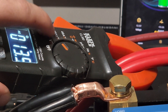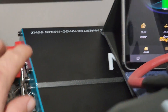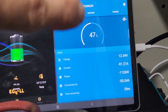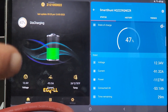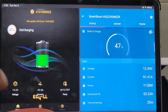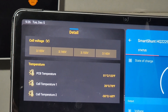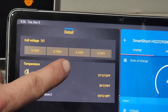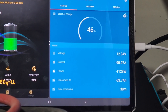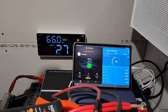We are 35 to 40 minutes into the test. The fans kick on every once in a while on the inverter — I'm only pulling about 1100 to 1200 watts. We have consumed 53 amp hours, which lines up with a 47% state of charge. Battery voltage is holding at 12.6 volts. Cells are all even. So far so good — it's doing better than I expected. Let's see if we can hold out or if the inverter will shut off before the battery does.